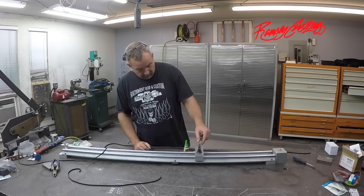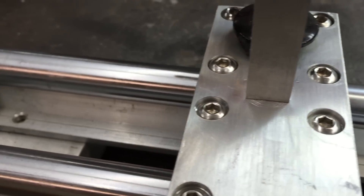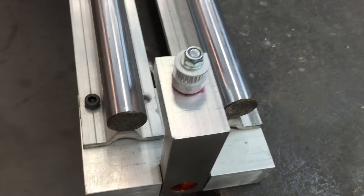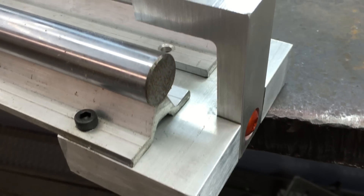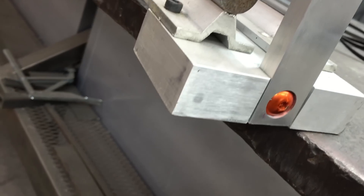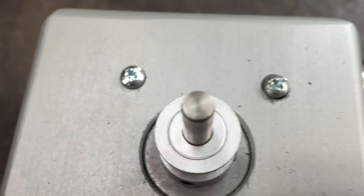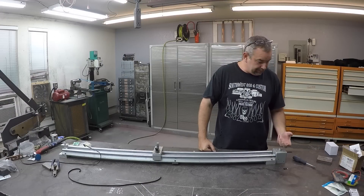I just thought I'd do a quick review of the cart here. I did some extra machining on this and added this station in the middle here that this is going to attach to. On this end where the idler goes, where the pulley wraps around and runs back and forth, we've got this block here, machined out the back of it, and a riser with an outer pulley. This is a steel three-by-three square tubing where we weld at the top, drill the holes, and the stepper motor is mounted underneath it.